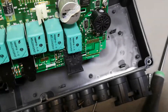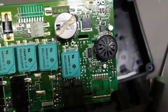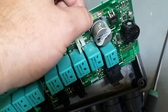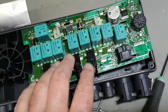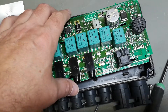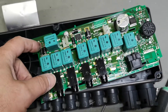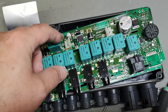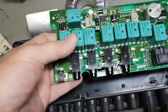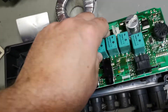I guess there's a little beeper — I wonder what that's doing. I don't see any microcontroller or anything, just some gates and an op-amp, or probably just a current sense, because we've got a current sense resistor. It'll just run the motors forward and back with relays, and then turn off when you've reached the maximum or minimum in whichever direction. It's probably a fast and a slow setting, so there's a relay for that — because we have two windings on the transformer.